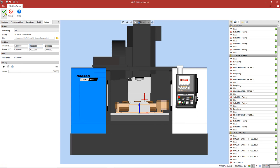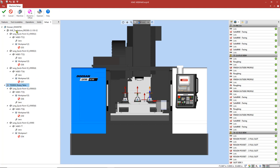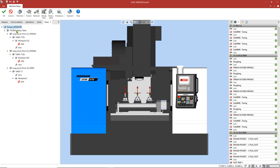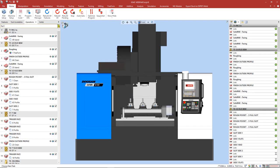Now we're going to cut one of the parts from our previous tombstone and paste it on each of the 3 locations for our trunnion and press apply. Now I'm going to delete the existing tombstone from the Okuma. I'm going to press OK. And now our program is going to rebuild itself with 3 parts instead of 4, with a trunnion instead of a 4th axis plus 1 on the Okuma.